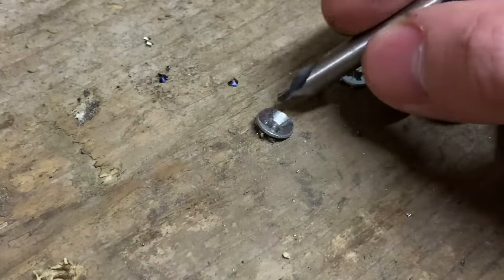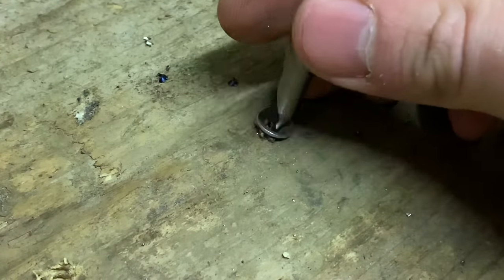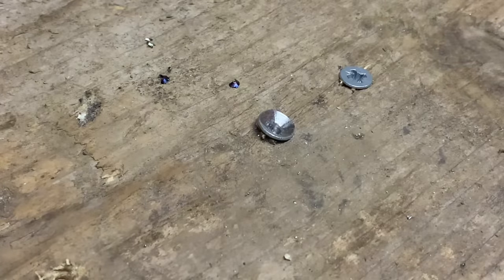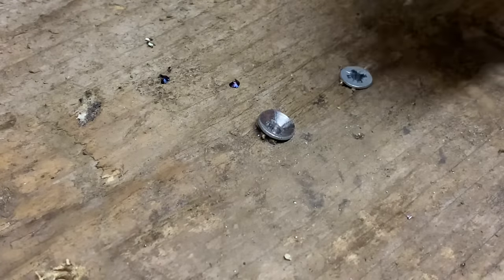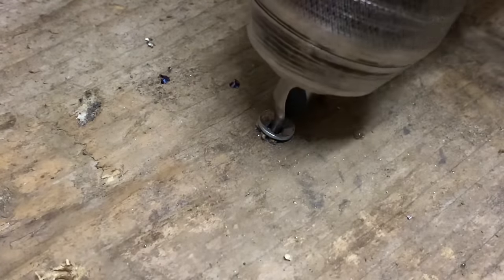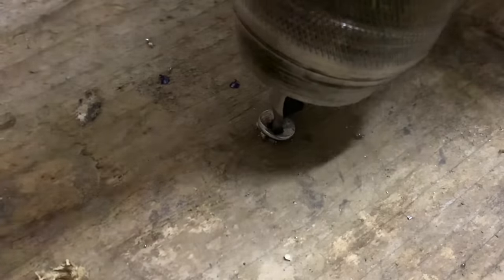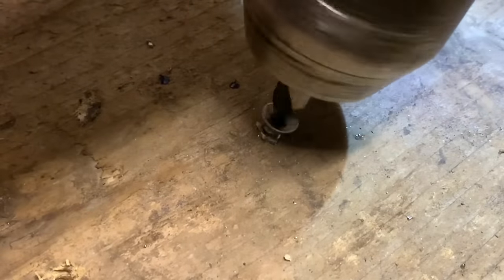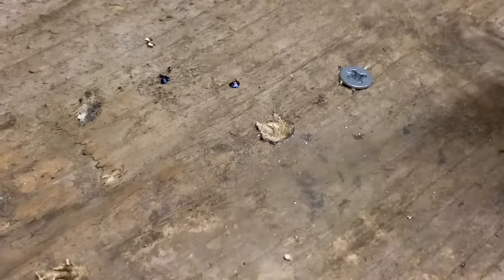We could even try the next size up. We're not quite at the shoulder yet, so I'm going to try the bigger one first, and if that gets it out, that's good. We've got the drill in reverse. I've gone nice and short on the bit because I don't want it to wobble at all. Nice and low speed, but the drill's on full torque, and it should lock up fairly quickly. As you can see there, we're taking that screw out — no problem at all.